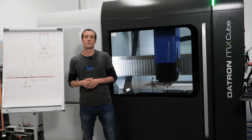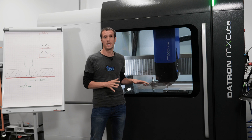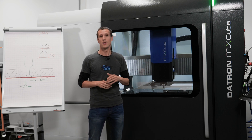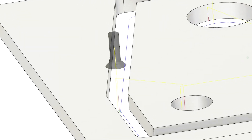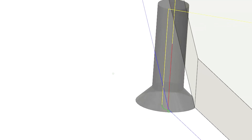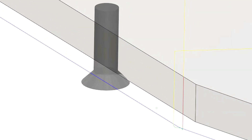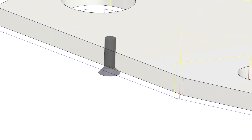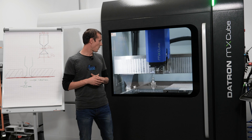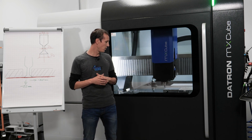The actual 2D milling is nothing too special — we go in a ramp movement around all contours and have one pocket. Let's take a closer look at the toolpath of the dovetail cutter while the machine is running. The lead-in starts inbound off the actual contour cut of the end mill, so it's very important we're not hitting either the part or the stock material. With a small radius of just a few tenths, we do that undercut and go kind of under the surface of the part. A regular chamfer tool is then used to create the chamfer from the top side — a pretty normal operation.